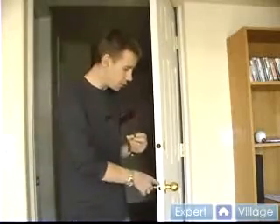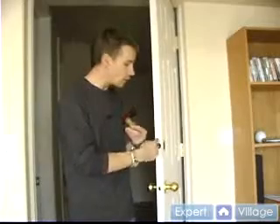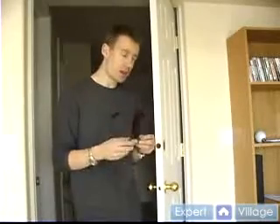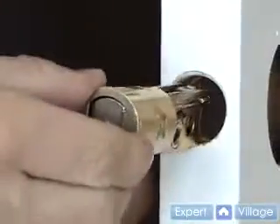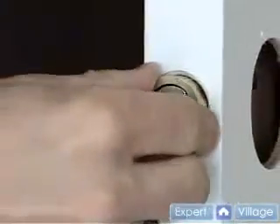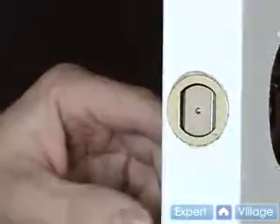This one's a drive-in. We went with a drive-in because it's just simplest on a door like this. We could have mortised it out like we did our strike plate, but on this one, all we need to do is just make sure that we're straight. Then we take a hammer or a rubber mallet and just tap it in until it's flush.